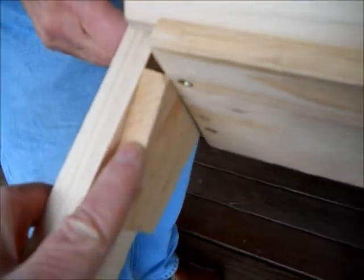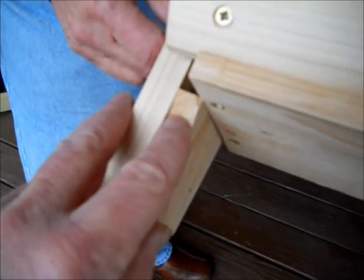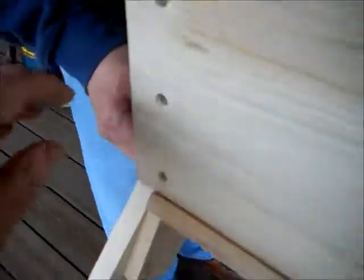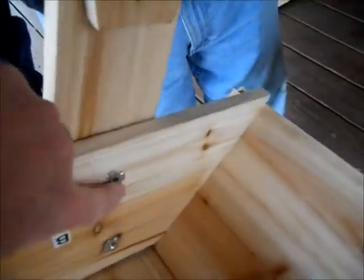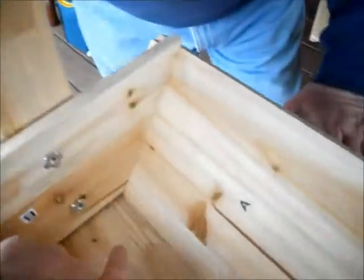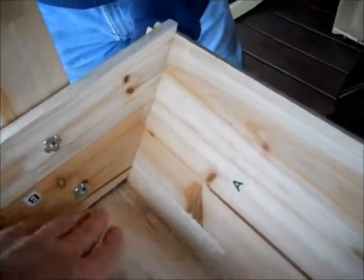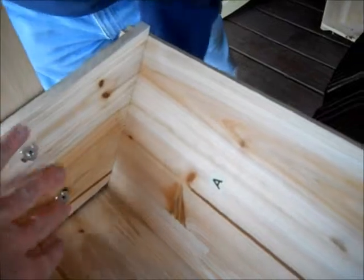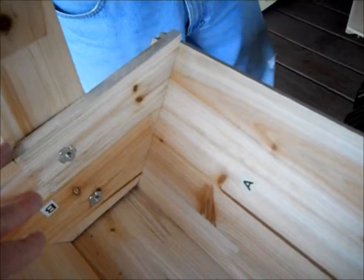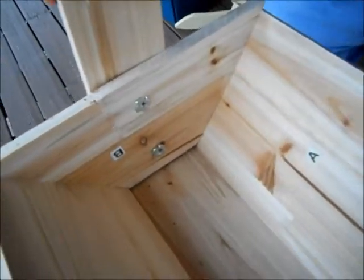We've run into a very serious problem where this assembly, now called Part Z, will not rest on Part E's thing, because where you put Part B, when you assemble these two, the screw holes have to line up with the screw holes in Part E. And since we have a little air gap down here, because you're doing it on the fly, trying to balance it, our holes are not close enough to the bottom to line up with E, and it's very disturbing. I think you'd be better off if you put Part B on first and assembled everything to it.